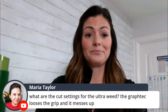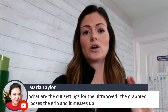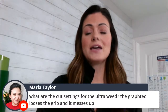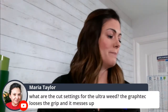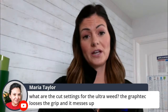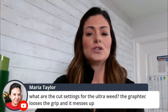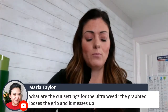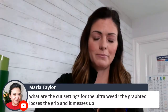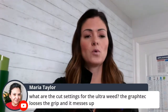Maria — loosens the grip and it messes it up. Let's chat after about that because there are a couple of questions I have. How fresh are your rollers? Have they been changed? Is your cutting strip okay? With the Roland, I am using 70 grams of force for cutting my ultra weed. Now I've cut glitter flake, flock, thermofilm, ultra weed, metallic — I've cut just about all of our materials with this particular blade. Since I don't have a production environment, I'm not cutting all day long. A lot of my customers would have multiple blades and they would start going through a system — when one blade would start to get dulled, it would become a glitter flake blade. So now that we went down this rabbit hole, I'll make sure we do some troubleshooting, whether it's with myself or the QE team, and get you taken care of.